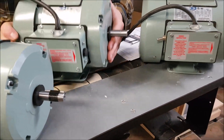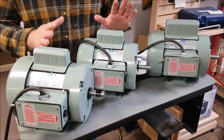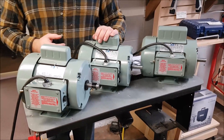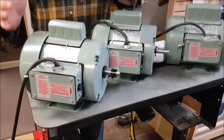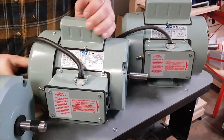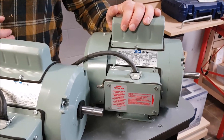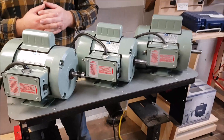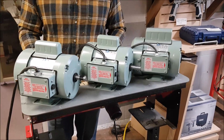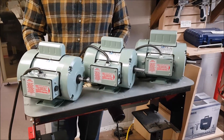These Flatmasters really don't require a whole lot of horsepower, which is great. The recommended RPM for all of them is 1725 RPM. If you have an 18-inch, we recommend a quarter horse or greater — our third-horse motor that we sell is the most common by far. If you have a 24-inch, a half horse or more — I've got the half horse right here. If you have a 30-inch, I would definitely recommend the three-quarter horse. There's nothing saying you can't put something more powerful on your sander as long as it's 1725 RPM, but in reality you don't need to.